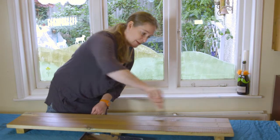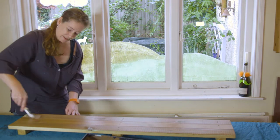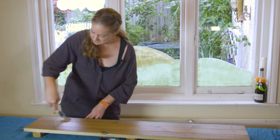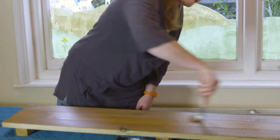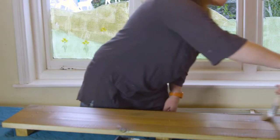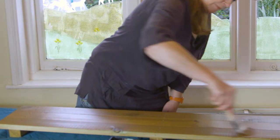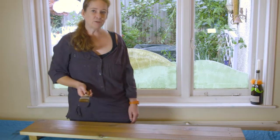Translucent wood paints actually go a long way, so spread it out nice and thin and evenly. Work it well into this knot and then you can just go back over with gently smooth even strokes, making sure that there aren't any patches. Lovely natural finish.